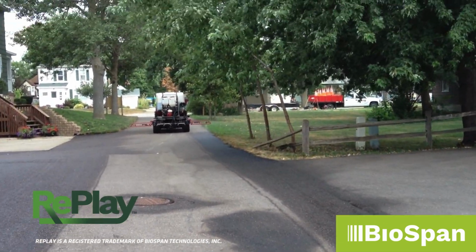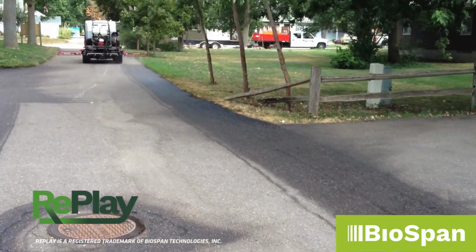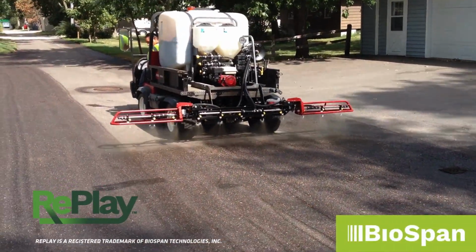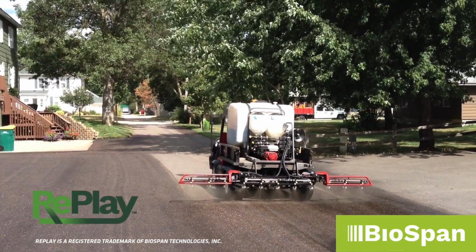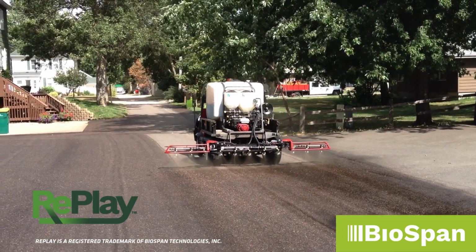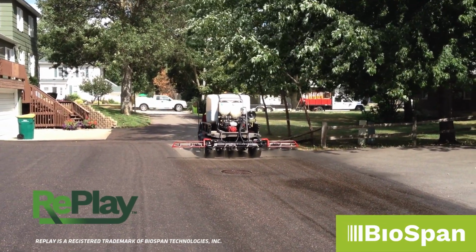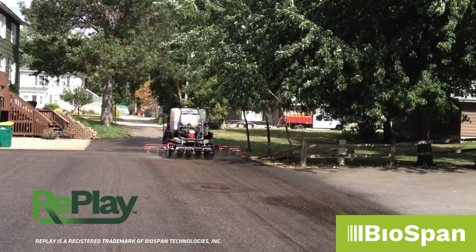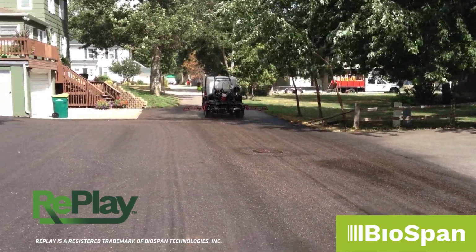What did that reveal? The carbonyl index is a measure of how much the asphalt has oxidized. They used a fancy technique called FTIR spectroscopy to measure this. The results were a bit mixed for some sections of the overlay, but overall the evidence points to RePlay's ability to reduce oxidation and slow down the aging process. Interesting. So they're looking at it from every angle, from the physical properties to the chemical composition, and it's all pointing to the same conclusion. RePlay is doing something pretty remarkable to the asphalt.